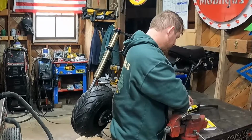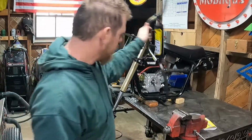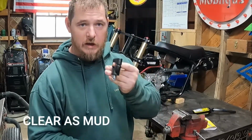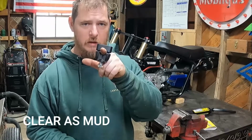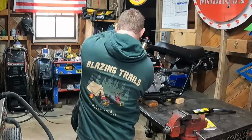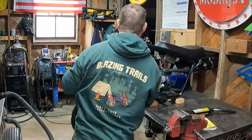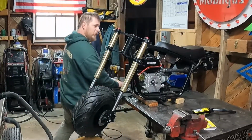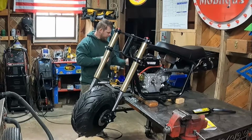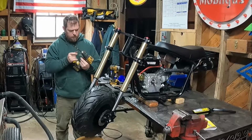Alright. We gotta get our clamps on here. Ooh, we got a Pro Taper SE 7/8 Mini bends. All right, here are our stock. These are what come with the Mega Moto, the handlebar clamps. So we're gonna go ahead and get these put back on here. Oh, and my holes are not quite big enough, apparently. So let's grab a drill. Go one size up, 3/8. Clean it out.